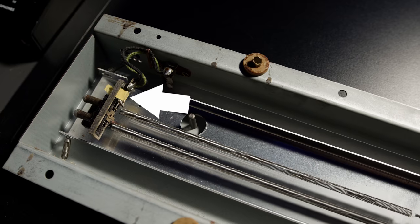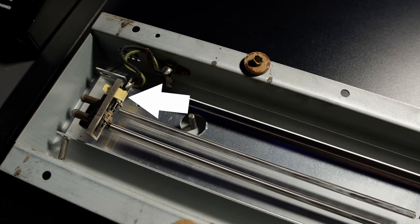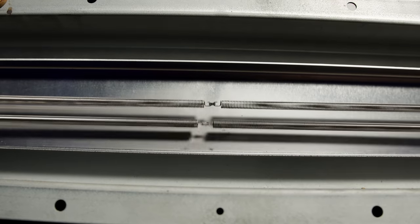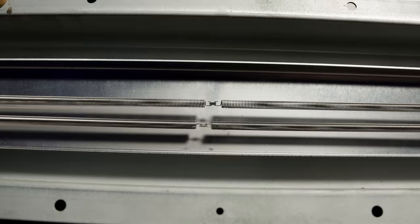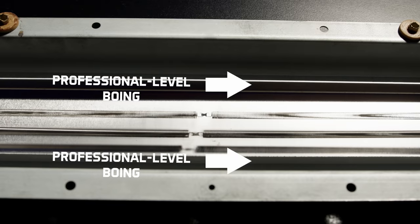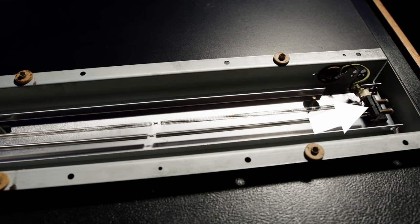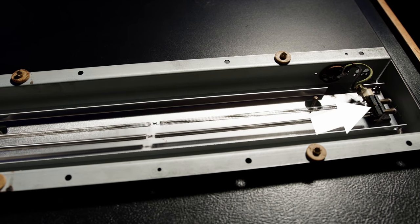The reverb tank operates in a very simple way. A suitable audio signal is fed into a transducer that turns that signal into mechanical movement that imparts kinetic energy into physical springs. The energy now present in the spring travels up and down it, causing a series of delays, and is then picked up by a second transducer and sent to a suitable recovery circuit that amplifies it and sometimes also features a basic tone shaping EQ.